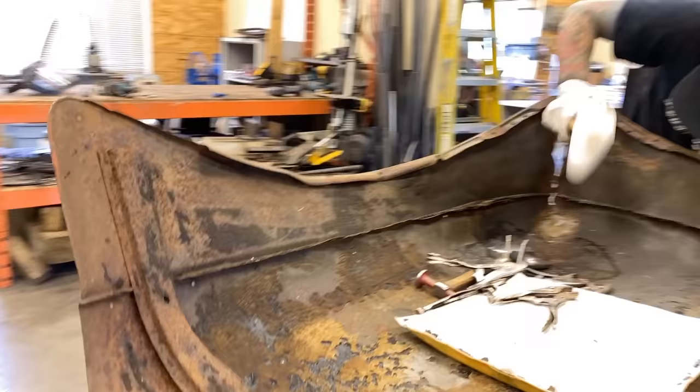Now, something I'm doing with the vice grips right now is a little trick. This piece is a little bit further away than this piece. So to bring this piece in and this piece out, I'm gonna clamp both pieces of the flange with the vice grips and give it a twist. So right down here on the flange, I'm grabbing it in between the two.